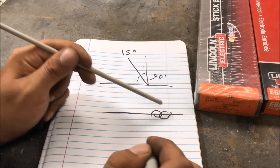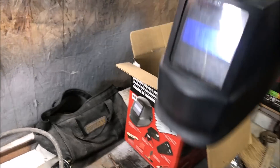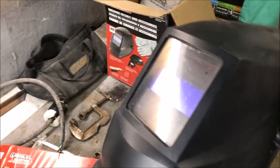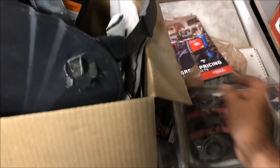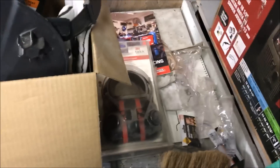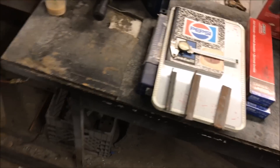When you first get started, I would highly recommend you find a kit like this — it's going to have mostly everything you need. The most important thing when you start welding is an auto darkening helmet. Don't even try to play around with that puppet mask with a handle — you have to have one of these auto darkening or you're going to delay your progress badly. The gloves are because it's going to be hot. Get a long sleeve shirt — I went to Northern Tool and got a welding shirt. Also get a whole bunch of safety glasses; you're really going to need all that stuff.